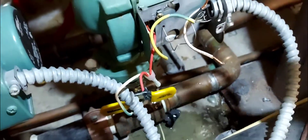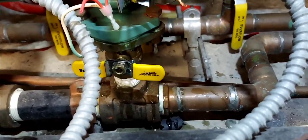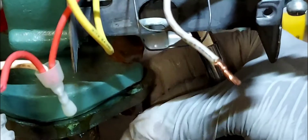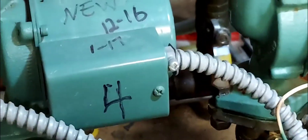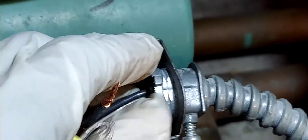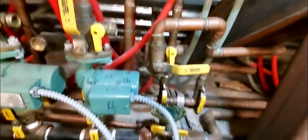I'll do another clip while the pump is out completely. It's already loose — I can just use my hand to finish it off. The bottom screws are loose as well. I can unscrew it by hand. There's the BX connector nut — I used a screwdriver to loosen it, then finished by hand. The pump is out.